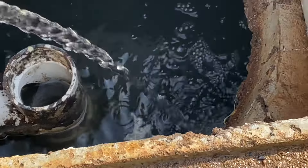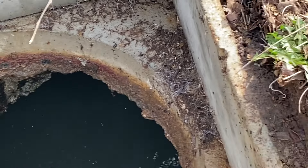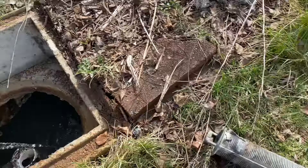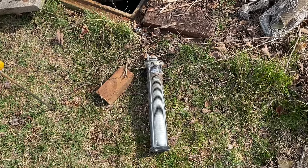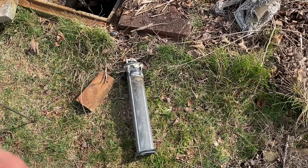This particular tank has something called an effluent filter. This device actually slides into that baffle and it will catch most of the debris that works its way into the drain field. If you're putting a lot of grease into your sewer system and you have an effluent filter, it's going to clog up and cause a backup in your system. The filter does its job by preventing debris from getting into the drain field, however you run the risk of sewage water going back into your home. So whenever you have these, it's super important to clean them at least once a year and avoid putting in any solids or fine particles that can get stuck inside this filter.